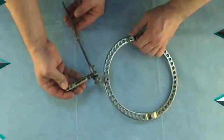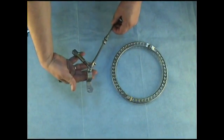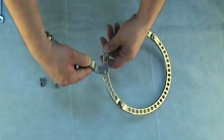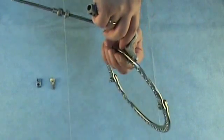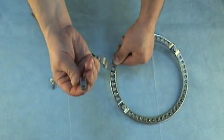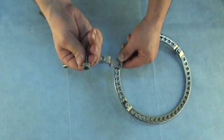It is also possible to fix a strut which was previously preassembled with a Z-shaped plate. Using the same method, we insert the finger into a hole on the ring, then attach a nut, and fix this connection with a bolt.